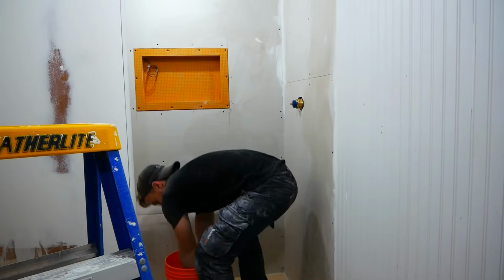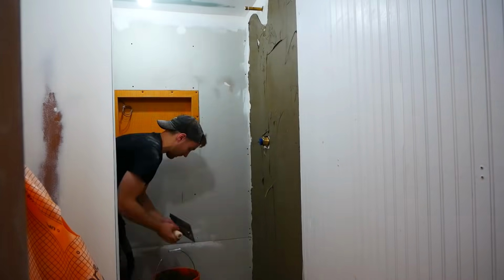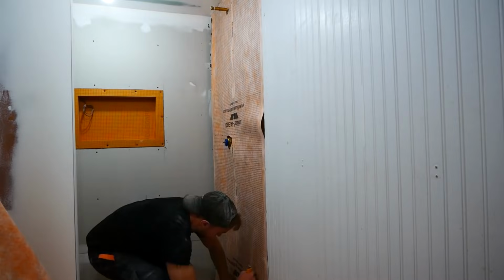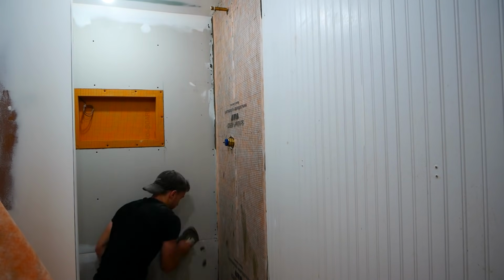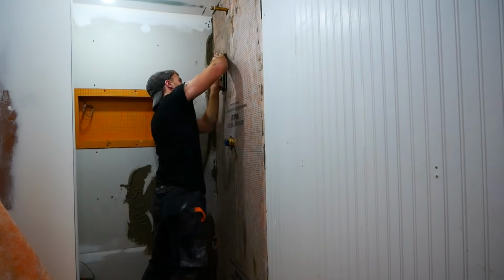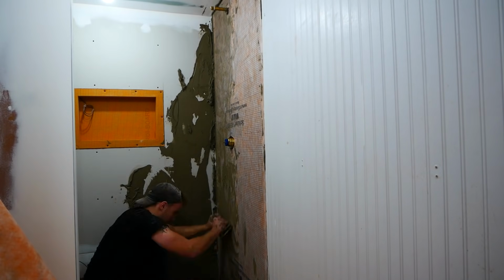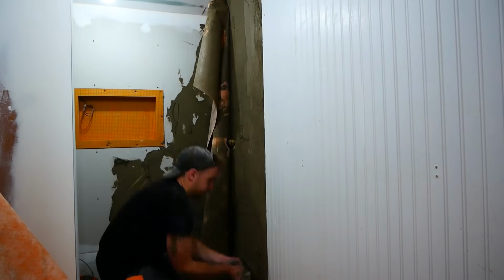The waterproof membrane was interesting. I'm a very messy worker, and this is no exception. By the end of it, I was absolutely covered in mud. I made a pretty significant mistake here, in which I had started out with the first 3 sheets or so using a grout float to get rid of all excess thinset. It just wasn't really doing the job, and later on I switched over to using a drywall knife and had much better results.